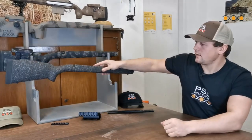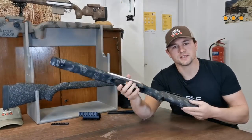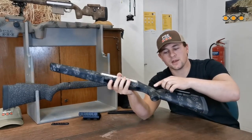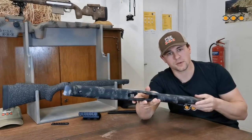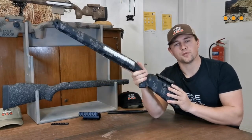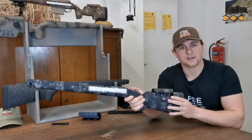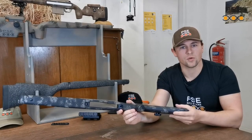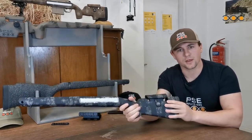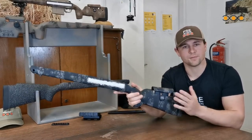The E-Lite and the E-TAC stocks have a very unique PSE feature — the pentagon shape pistol grip. We have defined lines down the left, right and the front of the pistol grip. What this does is it allows the rifleman to develop a feel for his rifle and to develop a subconscious orientation with this shape. It's very like a tennis racket — the racket handle is never round. There are always defined lines and a shape to it, so every time you pick it up without even looking at it you know where your hand is positioned. It's basically a memory effect.